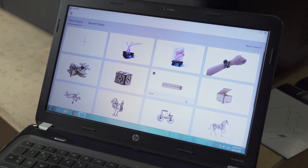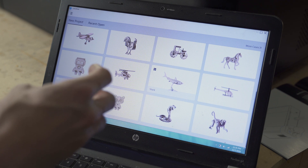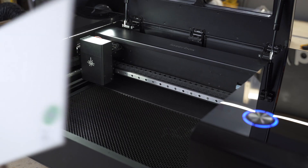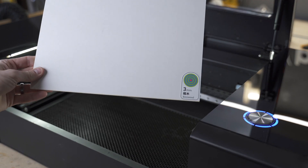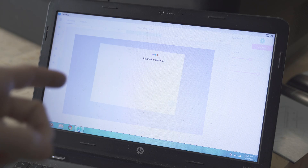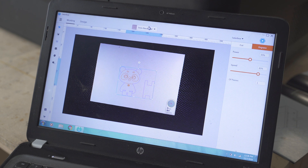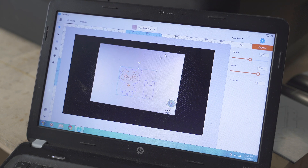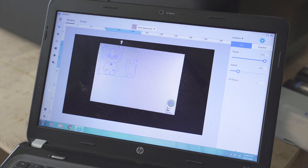The software gives you a bunch of sample projects to start with. This kit comes with a good bit of basswood to use as an example project. I think we're going to make this little iPhone holder. I've got some three-millimeter basswood — it comes with a code the software can read via the camera. We put it inside, it identifies the material, gives us an image, and shows 'three millimeter basswood' right up here. So I'm guessing all these different materials you can actually buy from them, and it automates all the settings — great if you don't use lasers a lot. It takes all the guesswork out. You can see the power and speed settings updated automatically for both engrave and cut.